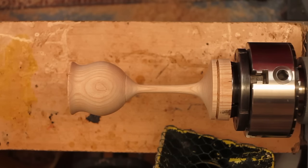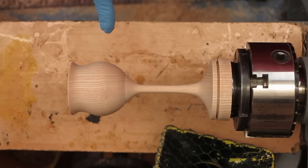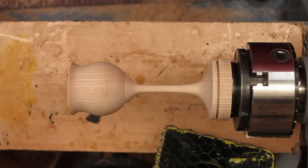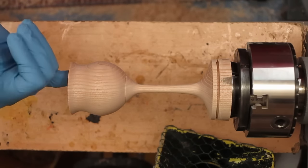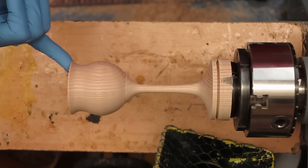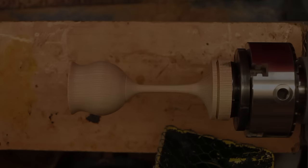So we'll have to see. And then I intend to, after I've put the sanding sealer on the spirit stain, randomly put hot glue on there and then use black ebonizing lacquer over the top, peel it off, and we'll see what we come up with. The other reason for doing the inside of the bowl completely is that hopefully the sanding sealer will stop any bleeding onto the inside of the bowl of the spirit stain. That's the theory, but we'll see if it works.